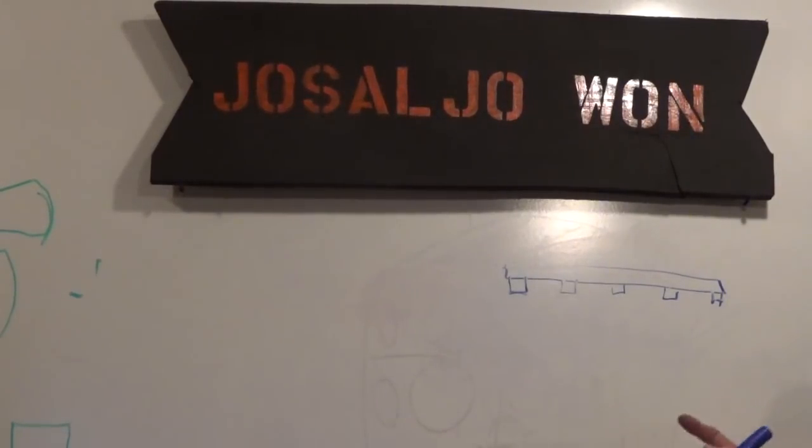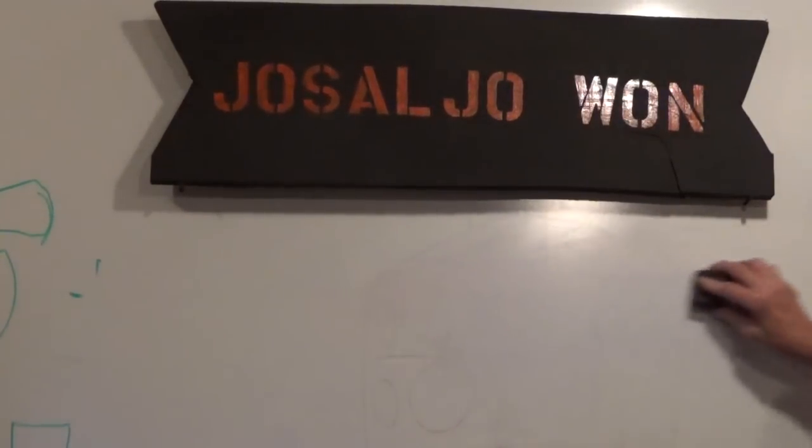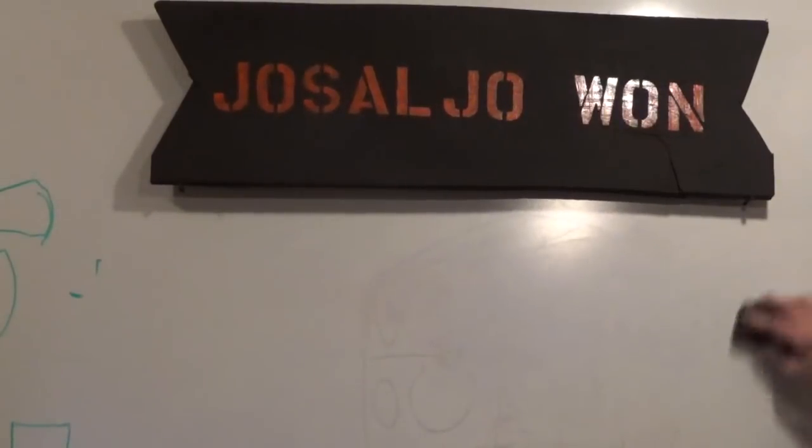I have examples of kiln-dried lumber also, so you know this, that has been end-treated and still checked. And I have examples of lumber that is not end-treated and does not have checks. So what's the right thing to do when it comes to end-treatment? End-treatment is a small part of the problem. The problem is removing too much moisture at too rapid a rate.